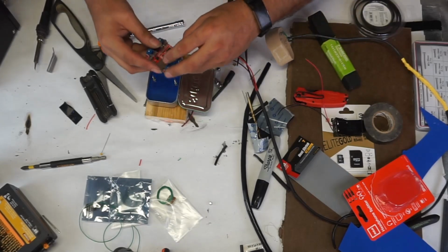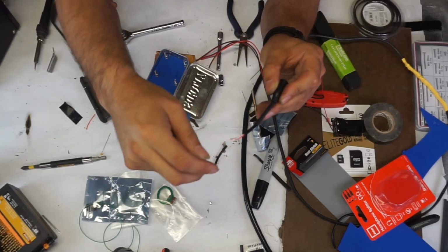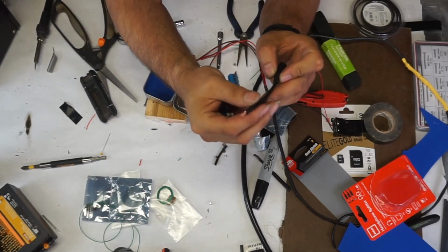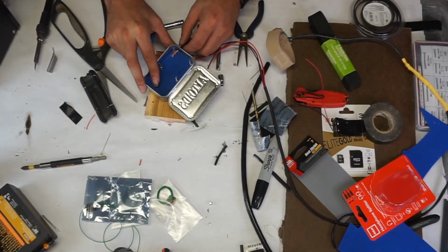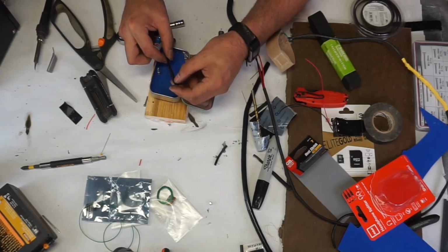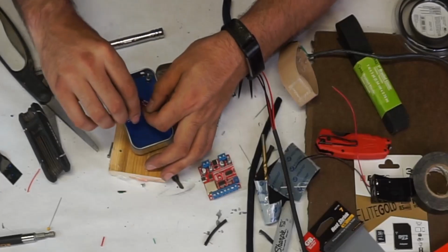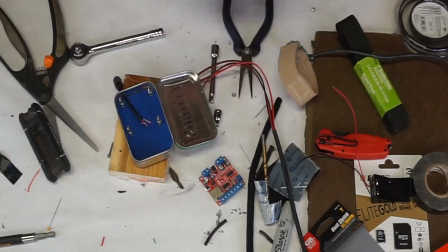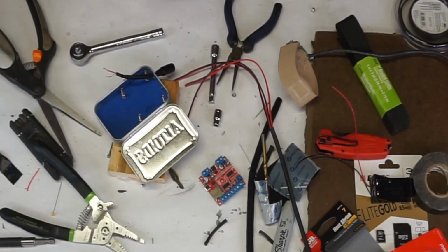These are my speaker wires. We'll start with those. Like I said, I just took an RCA splitter, put the positives together and the negatives on its own. Then I'm gonna move everything in, slide that up and heat seal it. But since I'm having the terminal exposed, I want to make sure when I add my heat shrink that it's far enough in that I don't have to worry about anything weird. So like how this sticks out just a touch too much, I don't like that. That's gonna cause problems. So I am going to cut that off right now. In this situation, any extra exposed copper, not my friend.